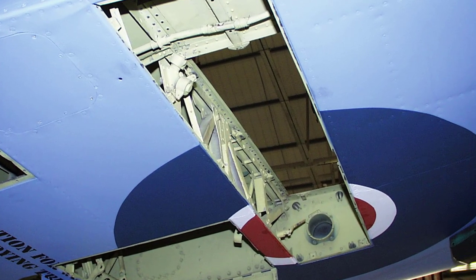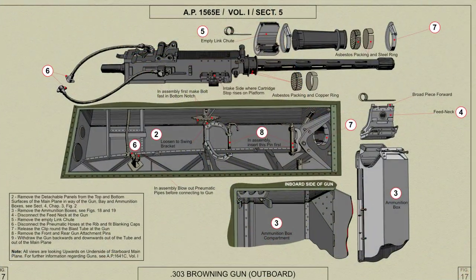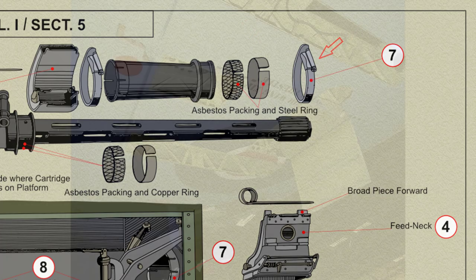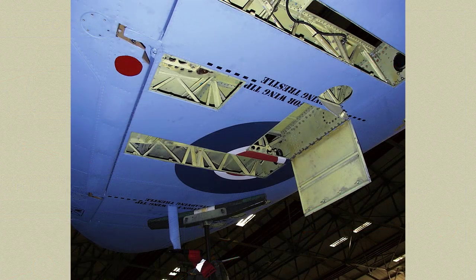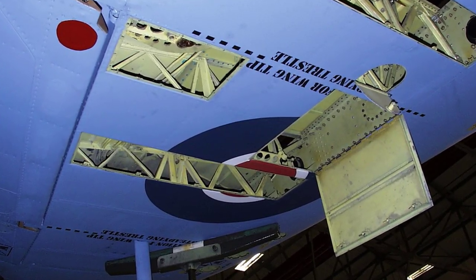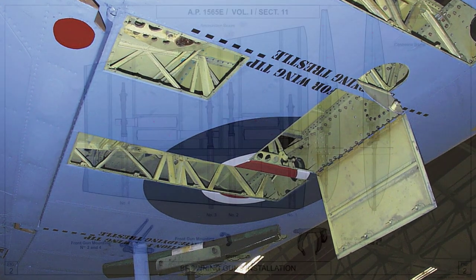When mounting a gun, the barrel should be offered into the aft end of the gun tunnel tube through the spar and leading edge. When the gun is mounted, a gas-tight joint should be made by the asbestos ring and bobbin fitted to the gun at the breech end of the barrel, and by the clip round the aft end of the gun tunnel. Care must be taken that this is a good joint. The clip should be slackened off when removing the gun.